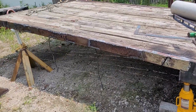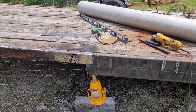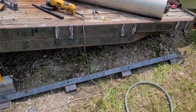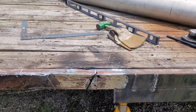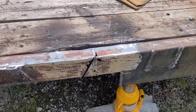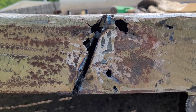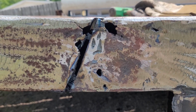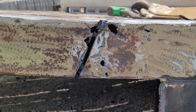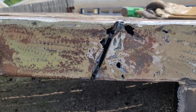But if you guys remember, this is the old car trailer I bought a couple years ago. That was broken, both sides. Cut the rub rails off. But this is going to be the new work platform for a two-post hoist. So that's kind of where it was broken. I had to widen out with a 1/4-inch wheel to keep the metal from binding up on it. But I'm going to end up welding a piece of 4x1/4 plate across here. Bolt it together. I got it pretty close to being level. It's been bent numerous times, so it is what it is.